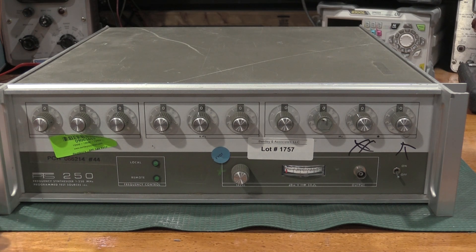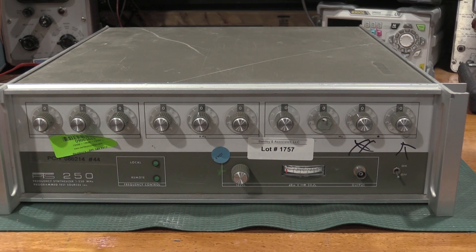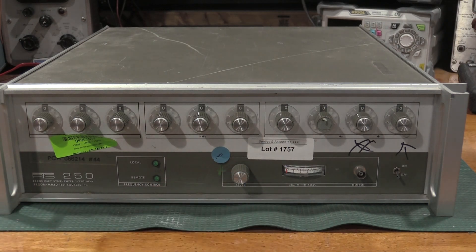This is one of those units that does one thing, but does that one thing incredibly well. This is what sets it apart from a function generator or something like that — the clock in this is much more stable, much better phase noise. It does one thing and does it exceptionally well, and that is generate an adjustable frequency. There's a meter here for dBm into 50 ohms, and it'll do 0.3 to plus 13 dBm into 50 ohm when it's working.